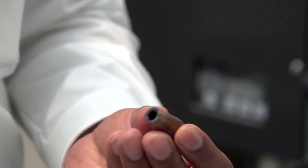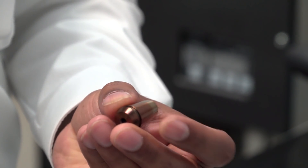We had challenges from customers — they need a different envelope for using heat shrink products on the Star sliding head machines. We took this challenge and developed a shrink collet, which is unique and patent-pending. We tried to give customers the closest runout possible, within three microns, whereas with existing normal spring collets — even high precision ones — when you clamp and declamp there is deformation and no consistency.